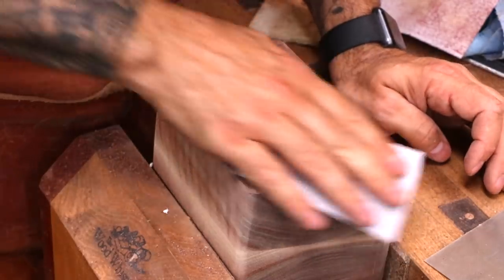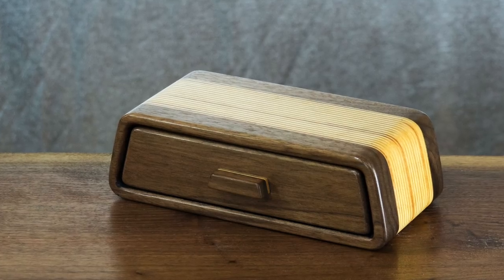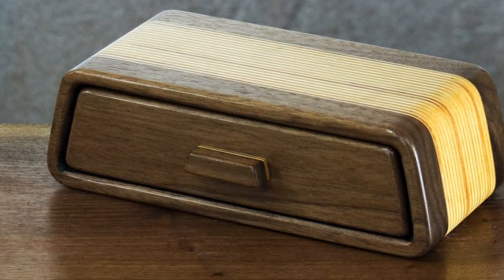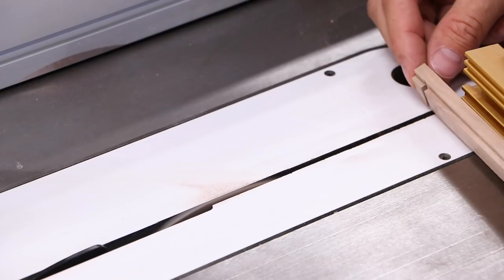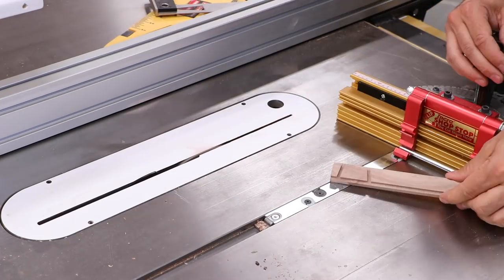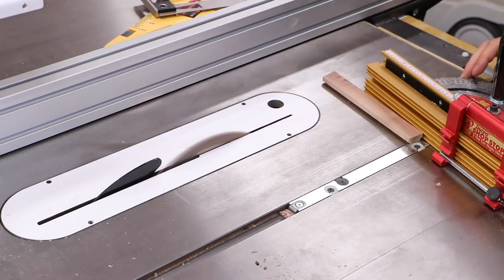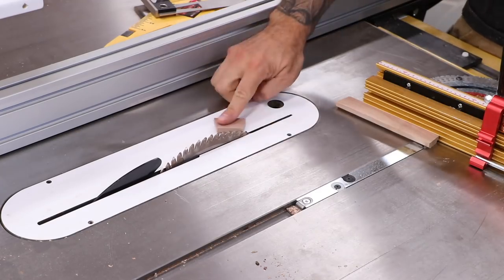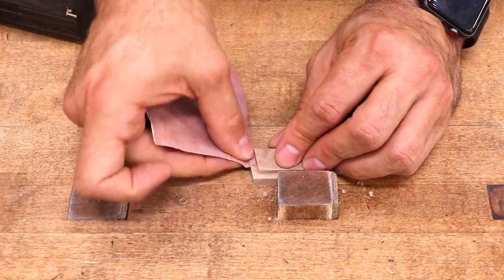Because plagiarism is a detestable thing, I'm going to completely differentiate my trapezoid box from Picciuto's. You see how his drawer pull mimics the shape of his box? Well, I'm turning my pull upside down — so yeah, totally different. The pull will be cut from walnut sapwood for a little bit of contrast. I start with a small strip with two rabbets cut into the sides, then cut two small dados at the appropriate angles. Now I can make angled through cuts to release the pull. This method results in a pull that sits up off of the drawer front surface, making it easier to grasp. A little cleanup and it's time to glue the pull to the drawer.